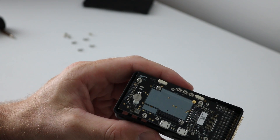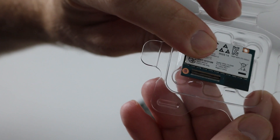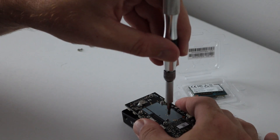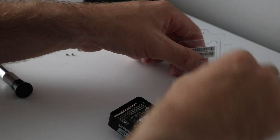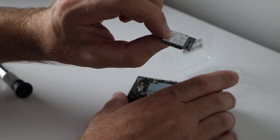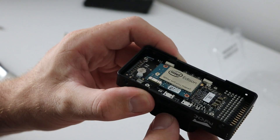I could pull the whole thing out but I'm going to keep it in there. What we have is a screw here and a screw here with the long connector, and that's the same long connector that — if we look at the back of the Edison — it will connect up to that on there. So the board itself would clip in like that. The first thing we need to do is remove those two screws. The two screws are removed. We're going to take the Intel Edison companion computer — and with anything like this you should be handling it with anti-static gloves; I've already grounded myself. We take the small computer, place it on the connection, and give a gentle press until you feel the connection go in nice and firm, and then it sits in the bottom there.